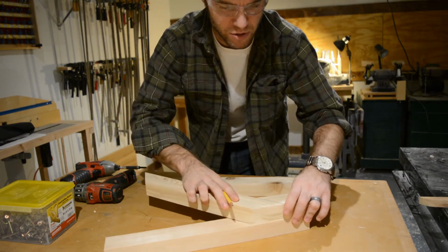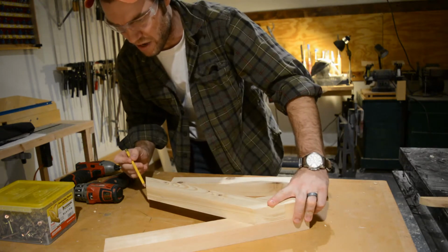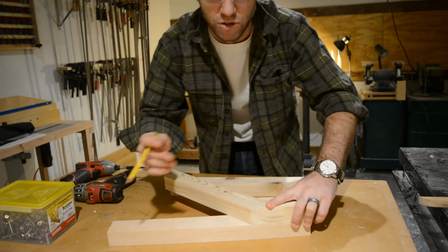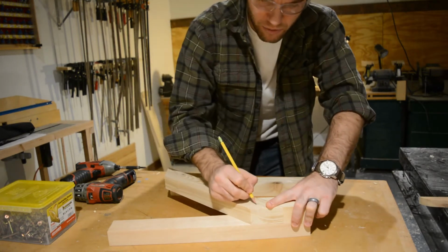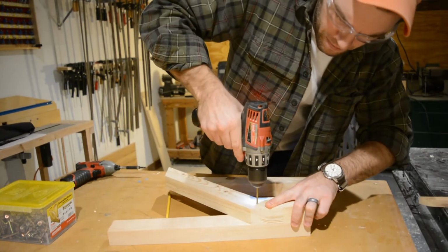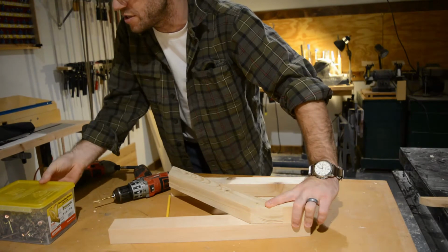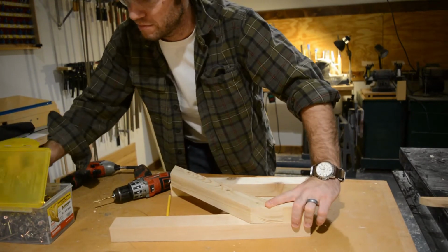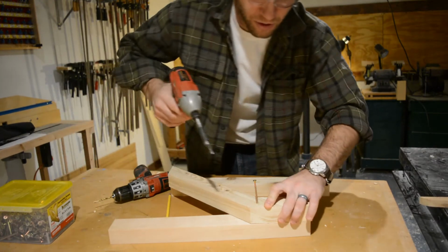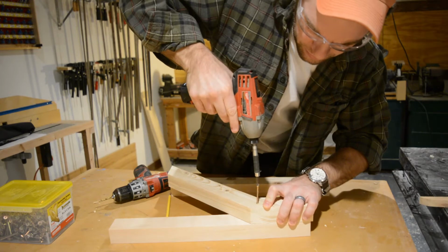It'll set this guy up so that when it holds up like this, we're about 3 inches from this spot to this edge right here. It's actually 3.5. That's how big your 2x4 is. And we're going to drill and screw right there. And so this is 2.5 inch construction screws. We'll just go on down in there, just like that.